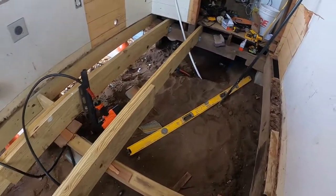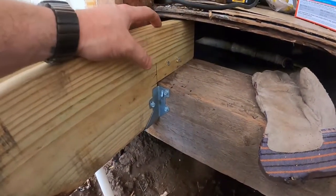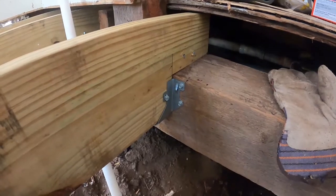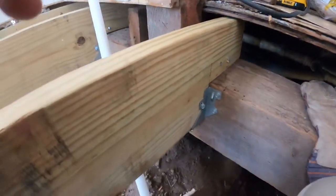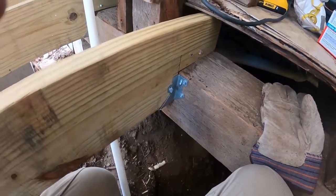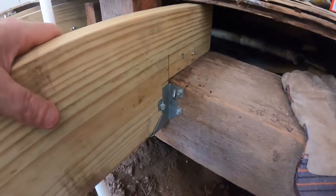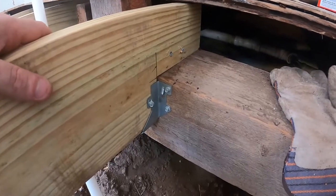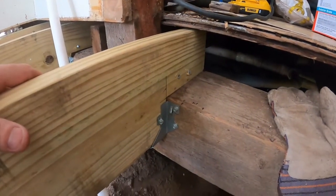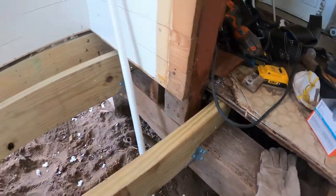If anybody's curious — because these are undercut — this is a two-by-eight with a four-inch overhang, so I'm using LUS24Z joist hangers — that's LUS two-fours, zinc-coated for use with pressure-treated lumber. I'm using screws instead of nails just because it's easier to work around everything in here, and I'm nailing the plies up in the center and nailing those to the four-by-four brace.